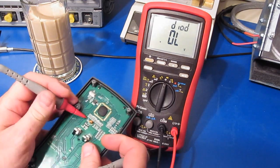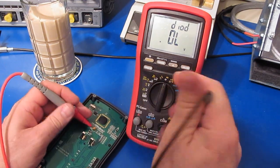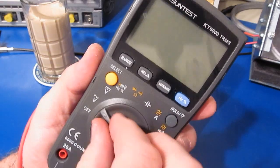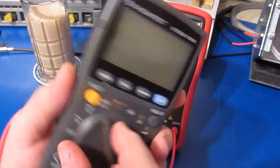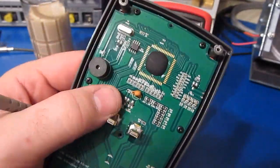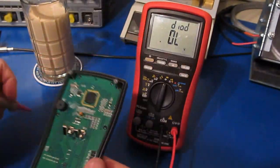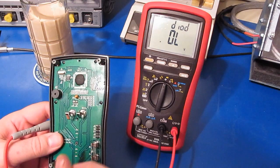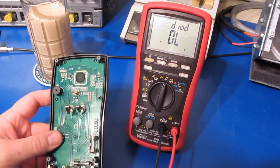So the little high-speed clamp survived this just fine, and you'd kind of think it would, because again, that only comes into play when you get into the millivolt and ohms ranges. We damaged the meter when it was in the volts mode, and that should all be switched out. So whatever was breaking down, it's something else. I suspect maybe the switch.